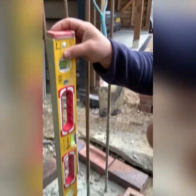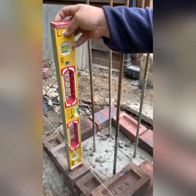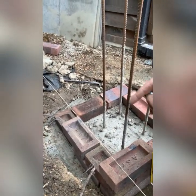Done that both sides. I've then uprighted, just using a 2 foot level, down from this string line onto the footing. Hold it against the line and upright down onto the footing, and at either end of the string, put a pencil line, and then join the 2 lines up and run a pencil line right across. Now I've run it out dry, the bricks against the pencil line, and done that both sides, and then I've eyed that through with a string line. It looks perfect.